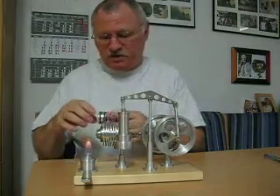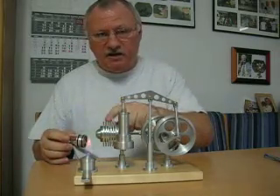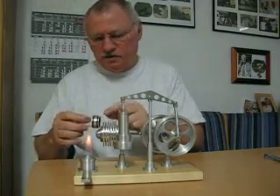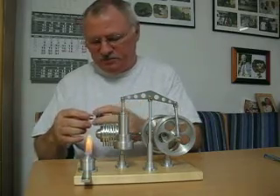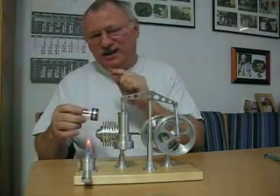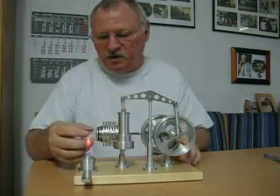The first feature is the system I'm using to make an airtight seal between this glass heating unit and the aluminum cooling unit. I'm using two o-rings spaced apart about 12 millimeters with aluminum rings, and the inside diameter of the o-rings is slightly less than that of the outside diameter of the glass, so that you have to stretch them over the glass.